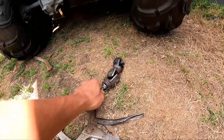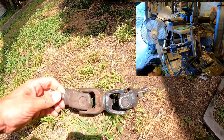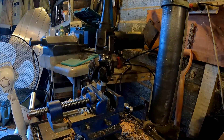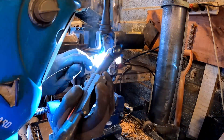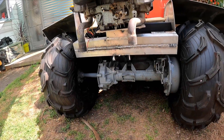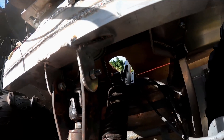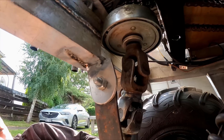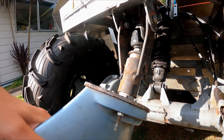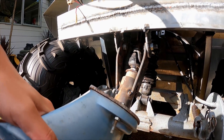G'day, Daniel Kazinus here. I've welded up this drive shaft — got two universals on it now. We're going to fit this onto the motor for the rear propeller setup. We've got that double universal sitting in place now. I've made the pivot offset so it uses both universals and it can slide on here a little bit without winding them up.